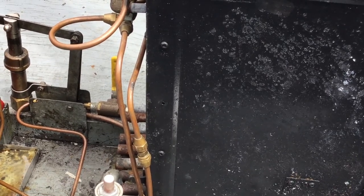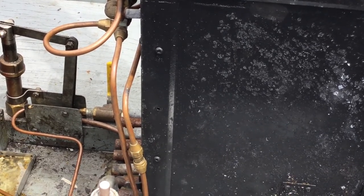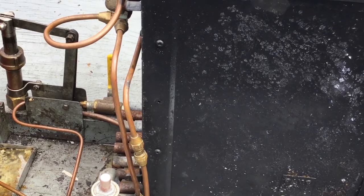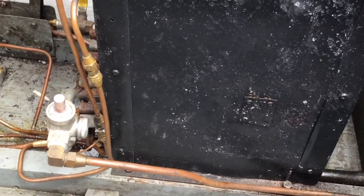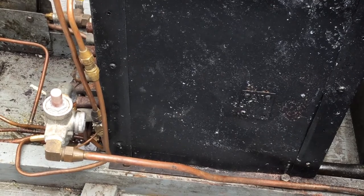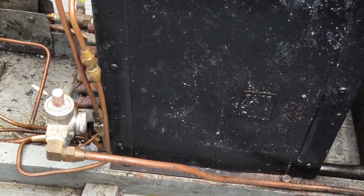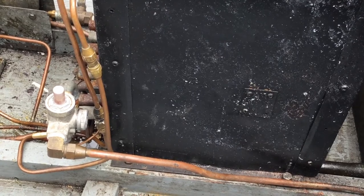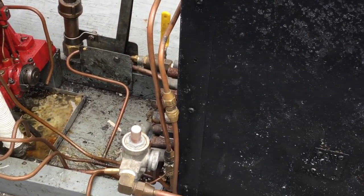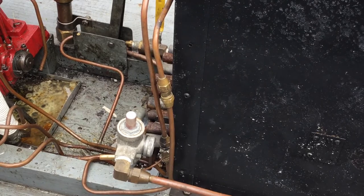It takes about 10 to 15 minutes to get it up to steam. I just like sitting here having a cup of coffee watching it. I don't bring it up fast. Where's the boiler drain? You can blow it down on the side with this valve here to see if you have any wet steam. It did have a steam trap on there. Water got in and it cracked — I think it was last year. I left the boiler wet overnight and it dipped down to 32 degrees. The boiler was fine — I hydroed it all the way up to 175 PSI with no leaks, thank God. It was the trap that was exposed and cracked.